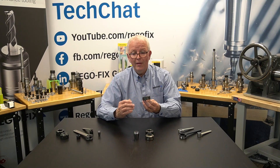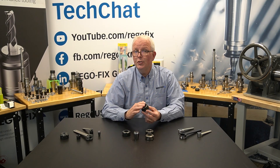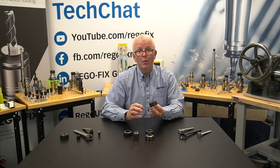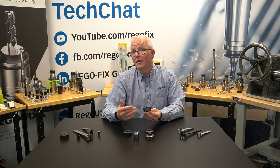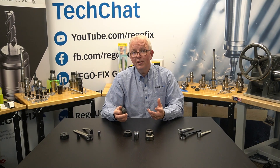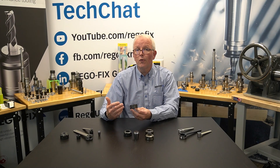The Hi-Q nut pretty much gave you the same improvement just with the surface treatment, but we didn't stop there. We also came out with a friction bearing style Hi-Q nut. This gives you about 80% more clamping force than the regular Hi-Q nut. It now has two chemically treated surfaces with the black treatment on them for lubricity. It does the exact same thing — removes the friction from the top of the collet — but because now there are two surfaces that are coated, it allows much higher clamping force. The nut has developed considerably over time: from a standard metal nut, through a friction bearing nut, to a chemically treated nut, to a chemically treated nut with two surfaces for improved clamping forces.